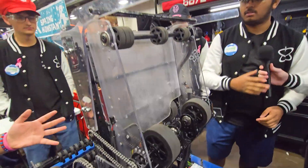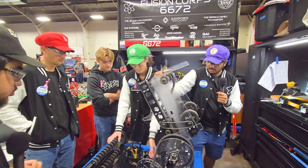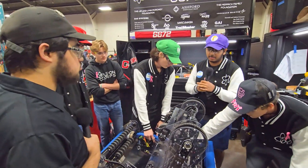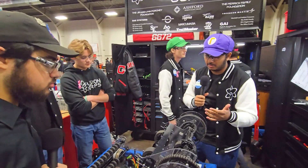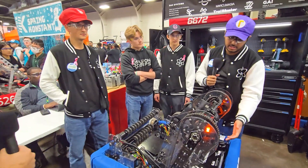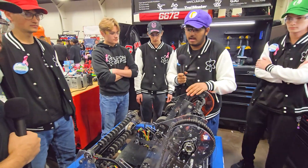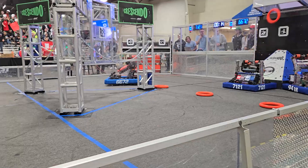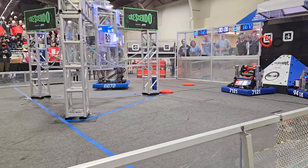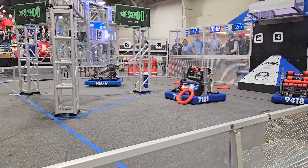Let's hand it off to Neil. Talk to me about your programming. Yeah, so one of the big things about this year was the April tags. We wanted to aim at the April tag and also, using an interpolation table, have our pivot aim so that we have the correct angle. We have a couple data points tuned at home such that whenever the Limelight sees the April tag, based on the distance between the robot and the April tag, the pivot will go to a certain angle and align itself so that we get a pretty accurate shot. For autonomous, we just use Path Planner and odometry to run our paths.